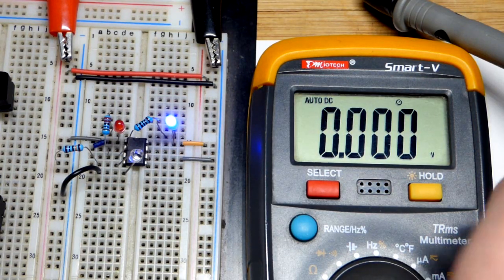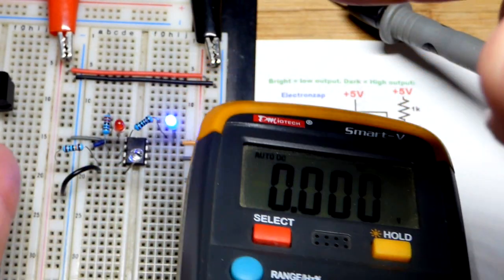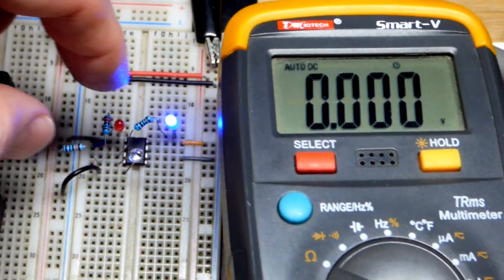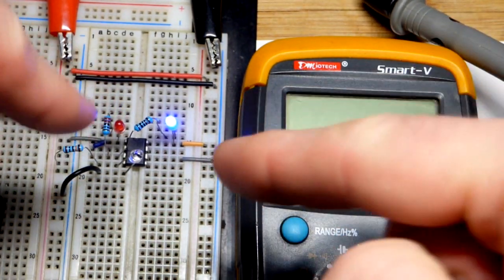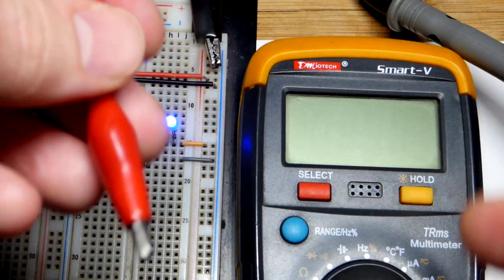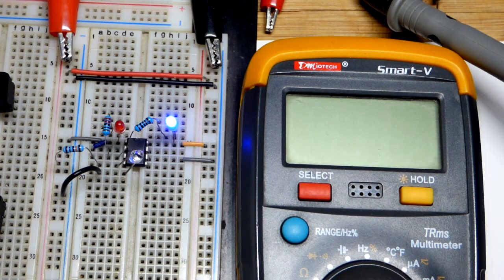Measuring voltage is pretty safe, but with current measurements disconnect as soon as possible. Usually you're holding probes by hand, but I don't do that here because pushing on components affects your reading — it changes how well connections are made. Breadboard connections themselves add a little impedance, and it gets worse when you push probes. You can still take good enough measurements, just be aware that pushing on components likely alters the reading. Anyway, this video was intended for absolute beginners — hopefully it was helpful. Thanks for watching.